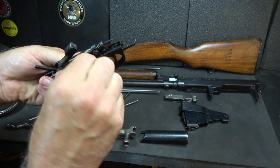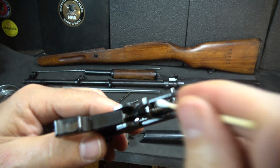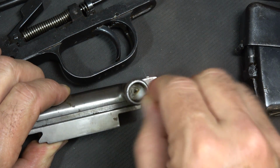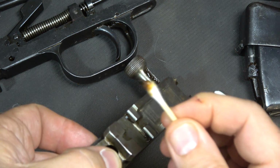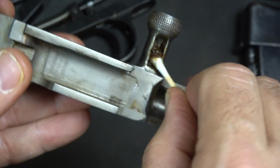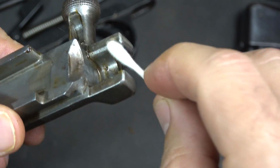So wherever the Cosmoline's kind of settled. The mineral spirits got a lot of it just spraying it, but there's some areas that it just didn't run off. Definitely down here in these springs. Wow, that's a mess. I may actually spray that a little bit with some mineral spirits. Here inside the bolt charging handle. Just never know where you're going to find it. Here underneath the charging handle. Wow. Considering Q-tips, or cotton swabs, are so inexpensive, I'm just going to use regular ones until we need the larger ones.